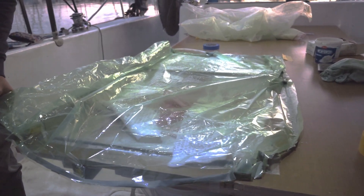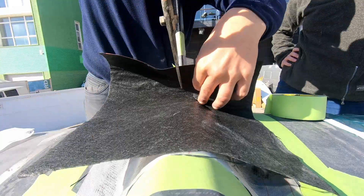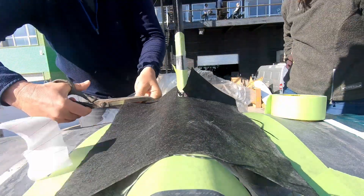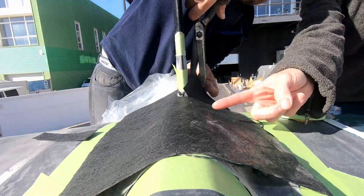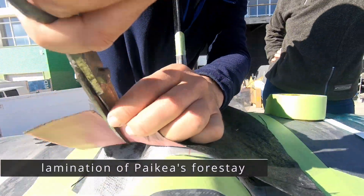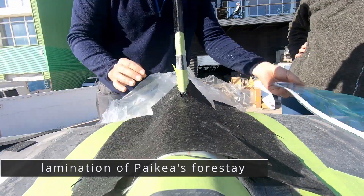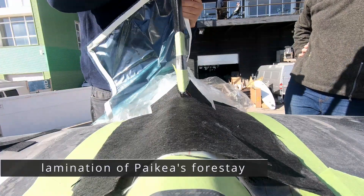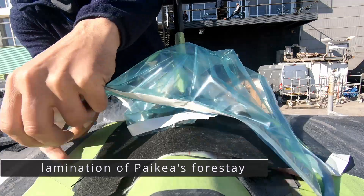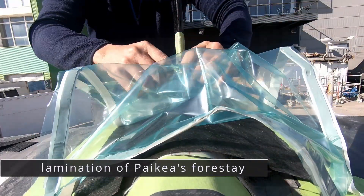I've been pretty careful throughout the whole process thinking about how I'm going to try and recycle my bag from the get-go - with the way it's laid out so that I don't get too much resin coming through and up into ridges. We're trying to race for the planet as much as we can. But when you're making boats, there is unfortunately a massive by-product of waste, especially if you're trying to use slightly more advanced techniques. We do want our boat light, and it doesn't matter what resin system you use - the end result is the end result whether you use polyester, epoxy or vinylester resin. If you want it light and conforming to some difficult geometry, unfortunately you've got to use vacuum bags.